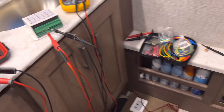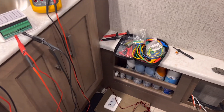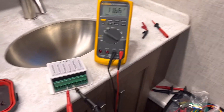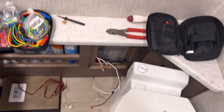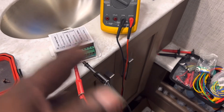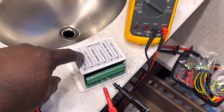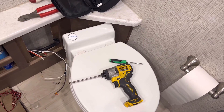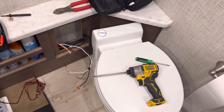Still troubleshooting in the blind, meaning I don't have my schematics - and you're not always going to be able to get them. Doing it the old-school way. When I connect the coach power while it's disconnected, I get a strong 13.6 volts. But when I connect it to the control box the voltage drops to two. So I thought the problem is probably going to be in here, because that shouldn't happen. But then I went to test my macerator pump - this thing was full of water - and when I gave power to the macerator it pumped the water out.